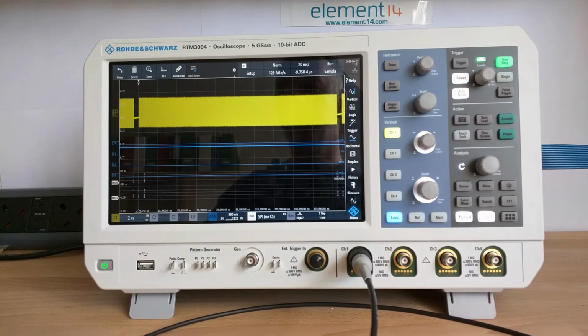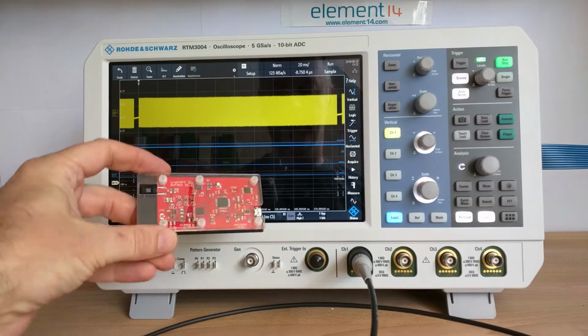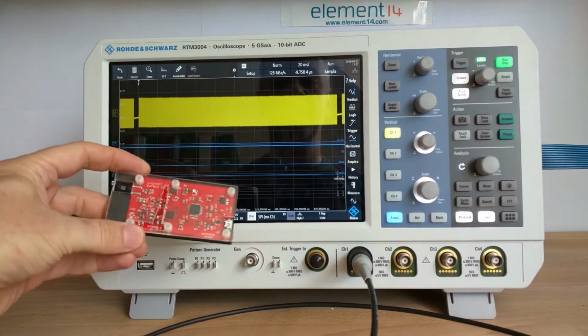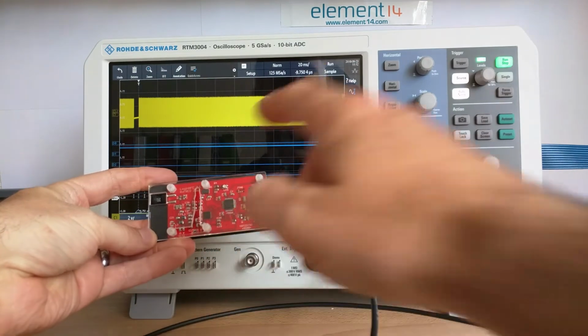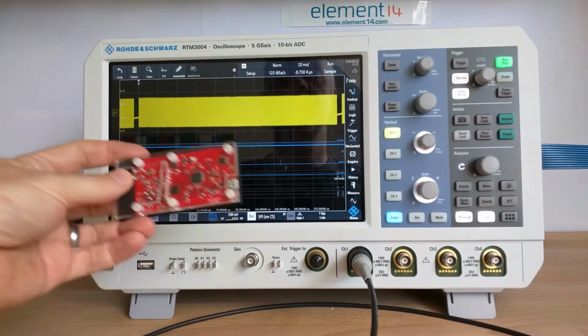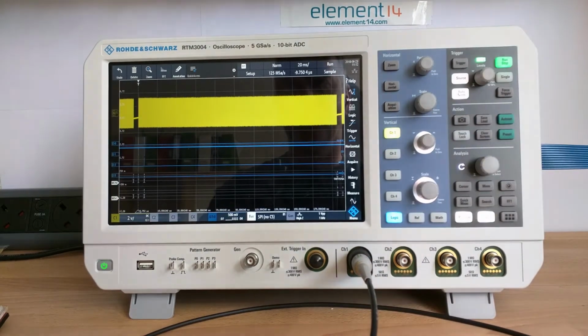So one of my previous projects was this NFC reader here to read the NFC chip embedded in my hand. It uses some SPI communication between the microcontroller and a TRF7970A NFC reader, and as part of this, the whole process of firing up the NFC reader, getting it scanning for NFC tags, waiting a while, and if one is not detected shutting it down, takes a very long, in a microcontroller sense of the word, 200 milliseconds.